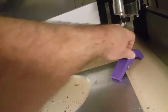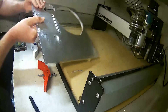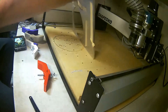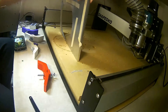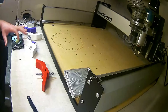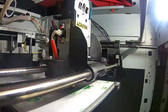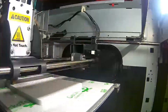I 3D printed my own bolt-down clamps and I really like those as well. I'm using quarter-inch bolts and wing nuts to add pressure. I also use double-sided tape. The one thing I wish I hadn't done on this project was add tabs — as you can see, the tabs are still there and I had to file them down. I really didn't need them because I used the double-sided tape.